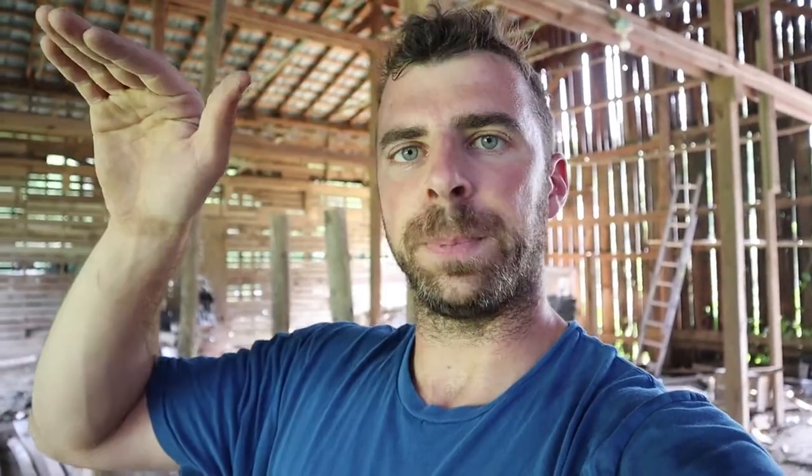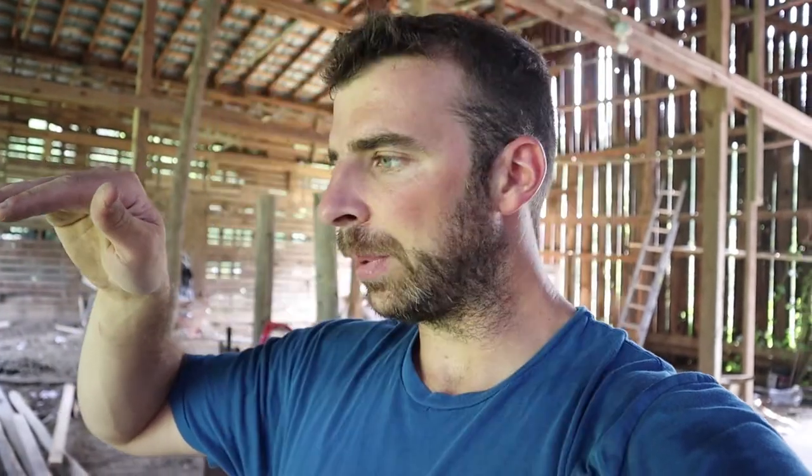The trick is typically when you put a ceiling joist or even a floor joist you want to look at the crown — that belly of the wood. Typically wood will either bend one way or the other, so you always do the belly up with the idea that you're going to put weight and it's going to try to straighten it out. This wood doesn't have a lot of belly, but when I nail them together I'm going to create a little bit of a peak, and then later when I put all that roofing material on top it should bring it down a little bit.